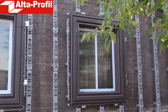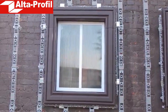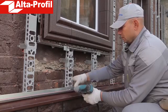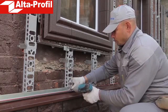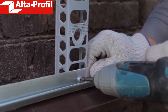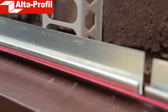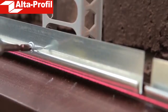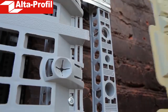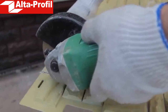This is what a window trimmed with the Alta Deco system looks like. After it is installed, you can proceed with installation of front panels. We remind you that we visually highlighted the base of the building with the bottom row of panels by setting a metal gutter on them. In order to start installation of a new row, we need to install a starting metal section. All the sections must be placed strictly horizontally — you can use a string for this purpose. The self-tapping screw is screwed into the perforated part of the wide flat section of the facade fastening system. On the outer corner of the building, the panels are mated with the fixing base of the corner finishing system, which we installed earlier.